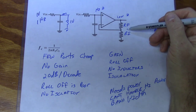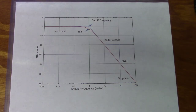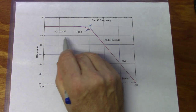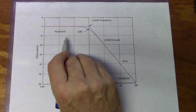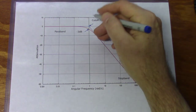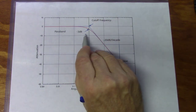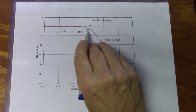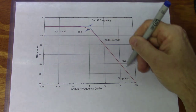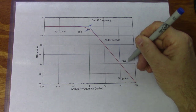Now let's look at some of the characteristics we'd expect to see in a low-pass filter. Here's a fairly typical graph of a filter's response — amplitude on one side over a range of frequencies. We have a pass band: all frequencies considered to be passed to the next stage. It's typical to say the pass band goes from 0 to the point where we get to negative 3 dB. Everything after that, along the red line, is called the skirt or transition region and is considered rejected.